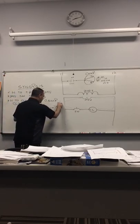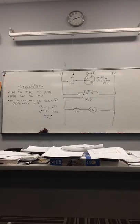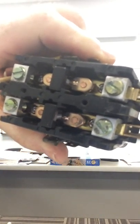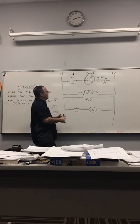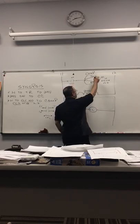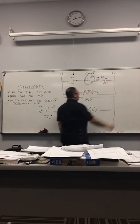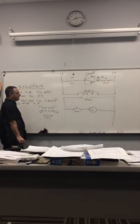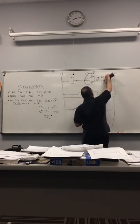I want to show you what a contactor looks like in the real world. You would have L1, L2, T1, and T2. Let's simplify our contactor — this is what it looks like. L1, L2, T1, T2. Now let's wire our motor the way you've been taught. The run capacitor is in series with the run and the start winding. Then we take the run and bring it through the other side of the contactor. So we just drew it like that.